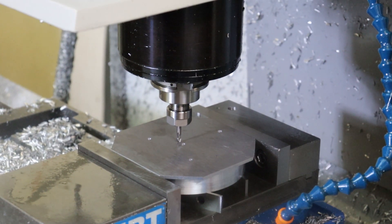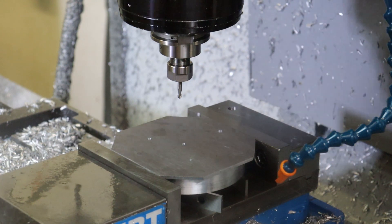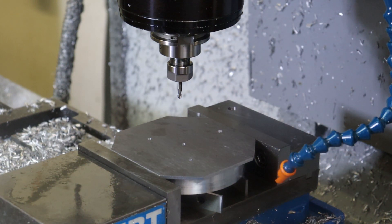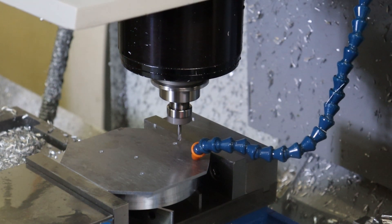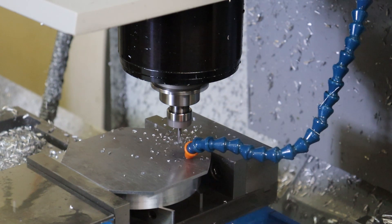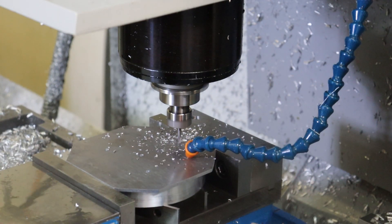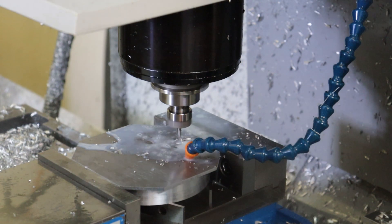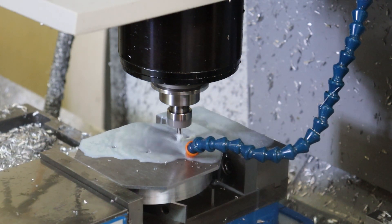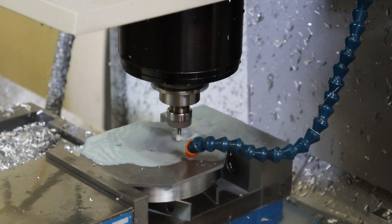The program is loaded. I'm going to double check the tool height - and I did set it. I set the center using the center finder, that cone shape thing. So we're set. We'll go to the first position for our runner, and this is going to be part of a tunneling gate as well. That's why the ejector is not quite at the end of the runner - we need some flex to pull the tunneling cone of plastic out of the part. This center ejector hole will also pull the sprue if there's any from the A side of the mold.